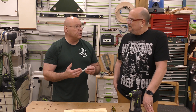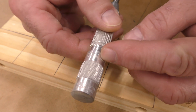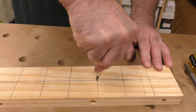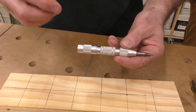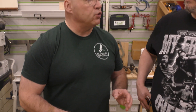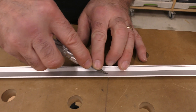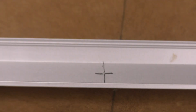This is one I use most of the time for steel — I'll show you on aluminum in a few minutes. You get your center point, and notice it says 'light' and 'heavy,' so I can adjust the tension. When I put it on and apply pressure, it's spring-loaded inside and I can control the amount of torque I put down on the point. I will not drill into steel or aluminum without creating a center point first, because it prevents the bit from wandering.